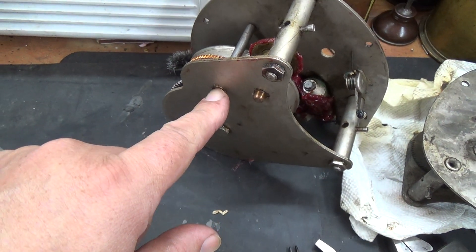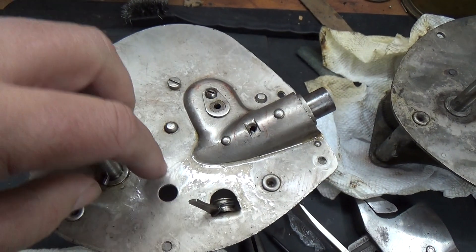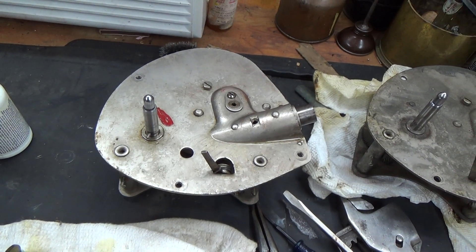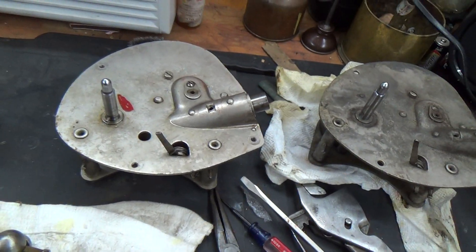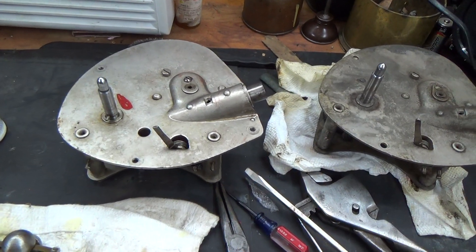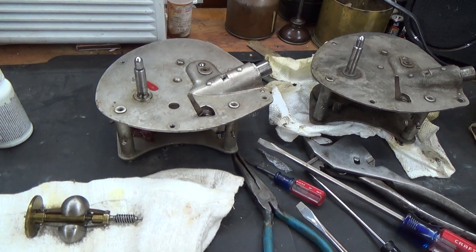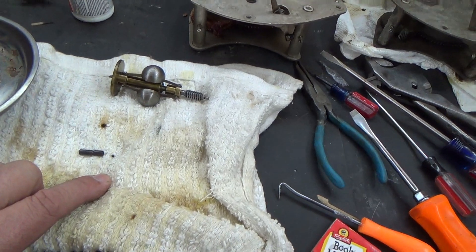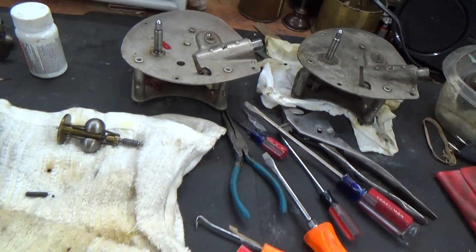You must have access to the motor for that. Same thing for these governor bearing caps — you're not going to reach them from above. You can put some oil at the top and it'll make its way down to the friction leather eventually, but it's not going to lubricate anything else on the governor. So you have to take the motor out to do it. I think a lot of times that's simply not getting done — not back in the day, and probably not today. This motor was supposedly fully serviced, the owner was told it was — it was not. This is a critical part of a service.